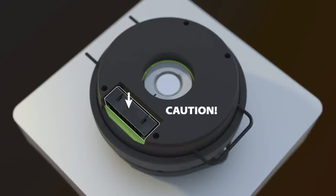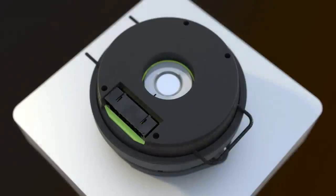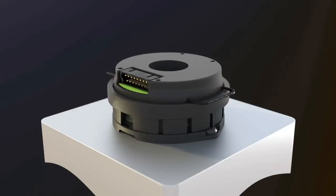Caution! Do not press directly on the encoder connector as this may damage it. Be sure to press firmly near the cover through-hole to ensure proper seating of the encoder optics. Remove the encoder spacer tool to free the hub disk assembly. The EC35 encoder is now properly gapped and ready for alignment.